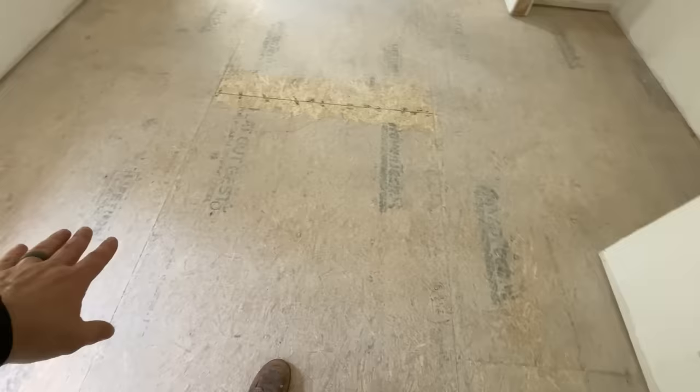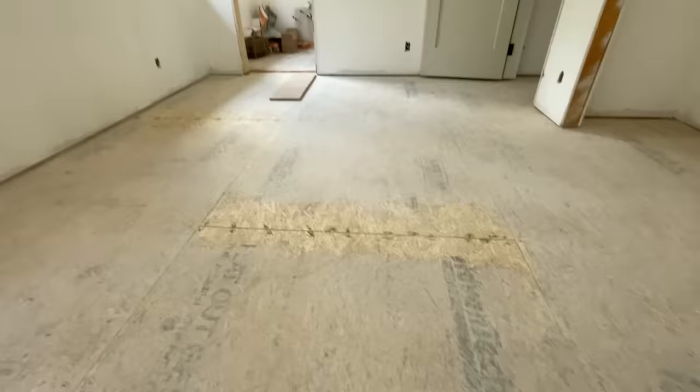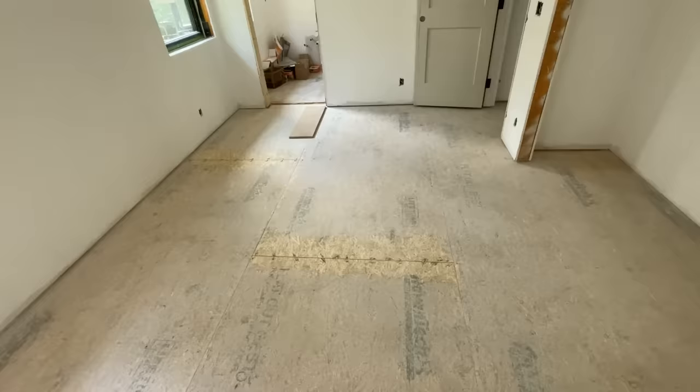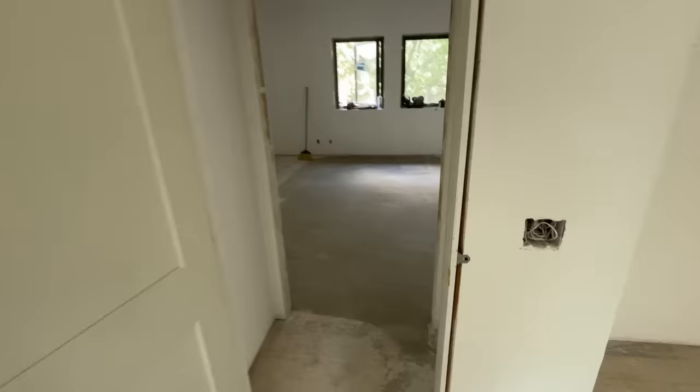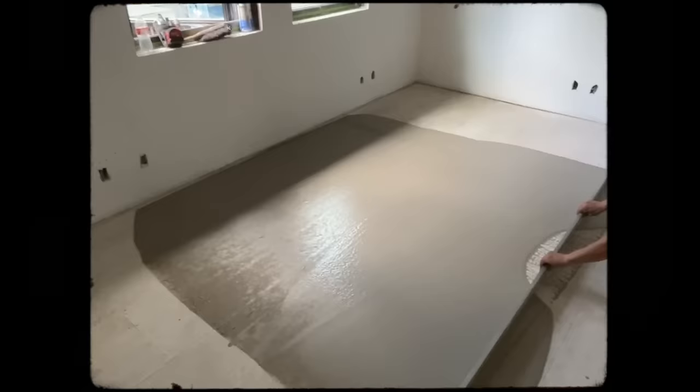After buffing, you can see they got some of the top grain off, but there's still a little sheetrock dust in the corners. They did a great job double-checking for high nails and found a couple of seam spots that needed a little sanding. We used an electric planer in a few spots and ran a giant level on the floor to make sure it was as flat as possible. There was a small depression, so we ran floor leveler to fill that - it dried super fast.